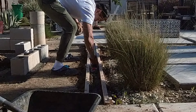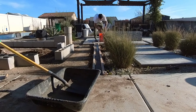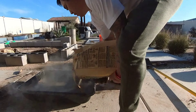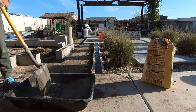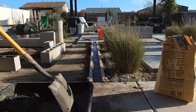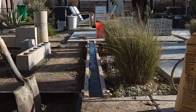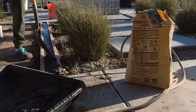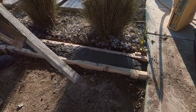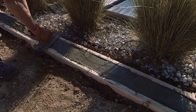A standard trowel is about four inches or so — it's too wide for this gap — so I'm using my three and a half inch magnesium float and that worked perfectly. Now that the first layer is in I'm getting ready to add a second layer; this time I'm only using half a bag of concrete. Now I'm going over the top, scraping off excess concrete, and using a trowel to push down the top layer, which allows the smooth cream to rise up to the surface.